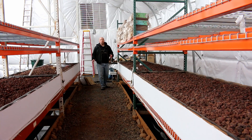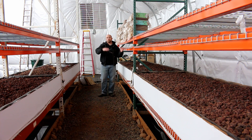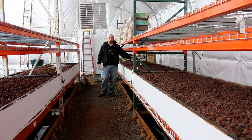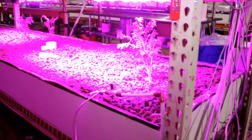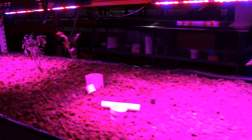Whenever you're doing any aquaponic design, you need to really consider your power consumption and available power. Two more problems we had are shading — this is the north side of the building, so as things grow toward the south we'll get shading — and vertical farming, which means you need more LED lights, which means more power. So how you set up everything and account for shading is a major consideration.